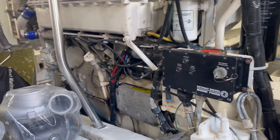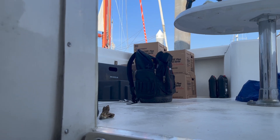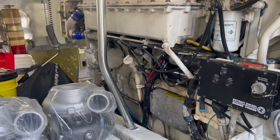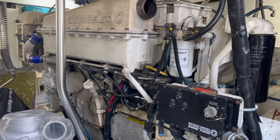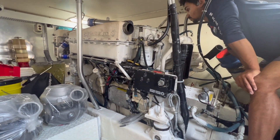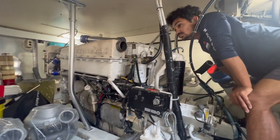AC's going on, so we're going to put everything back together again. We got the right coolant - the Detroit Power Cool Plus - which is not the same stuff that was in here. In order to do that we need to flush out the entire system, because the stuff that was in here was the green stuff, the ethylene glycol, and we can't mix the two. So we're going to have to flush both systems.